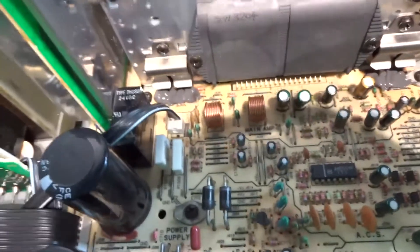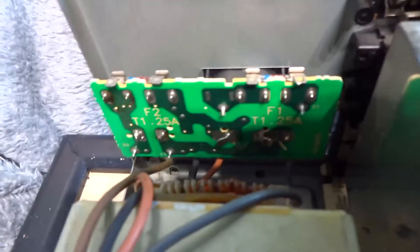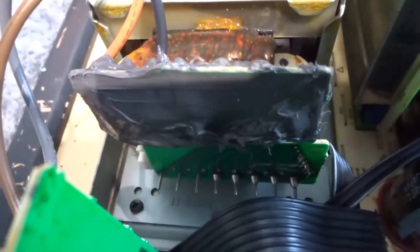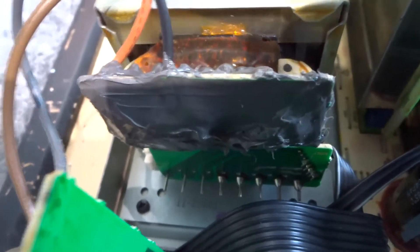This is going to be fun because I've got to strip the whole amp down to get to it. What I've done here is a safety measure — on the transformer I've just put some silicone over the live terminals here, because that there is live from the mains and so is that. You don't want to be touching that or you'll be dead. I could do with putting a plastic cover over that as well — that needs doing, that's a certainty.